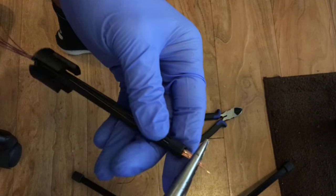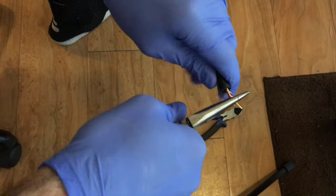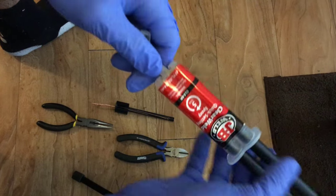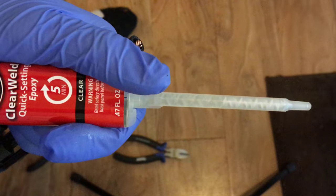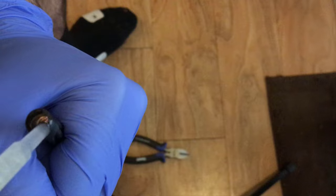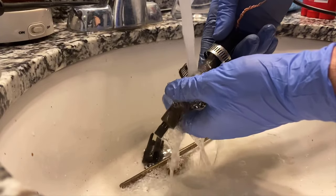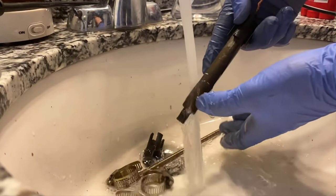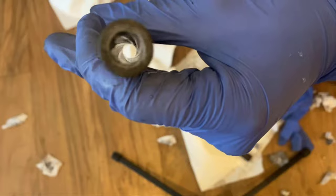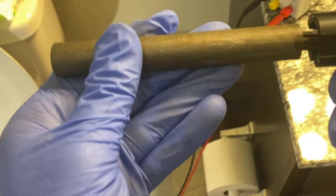The rifling mandrel is pretty easy to do, although just take everything slow. For the top part of the mandrel, all you really need to do is make sure all the wires are nice and tight together, and then you can cut off the rest. I also found myself using JB Quick Weld instead of JB Original Weld, mostly because I didn't want to wait 18 hours when it was already closer to midnight — and the five-minute cure time is pretty good, and the strength is just good enough for what we're using it for. Once you get past cut two or three, it becomes significantly easier to have it index, since the cuts are already deep enough where the mandrel just slides into place perfectly.